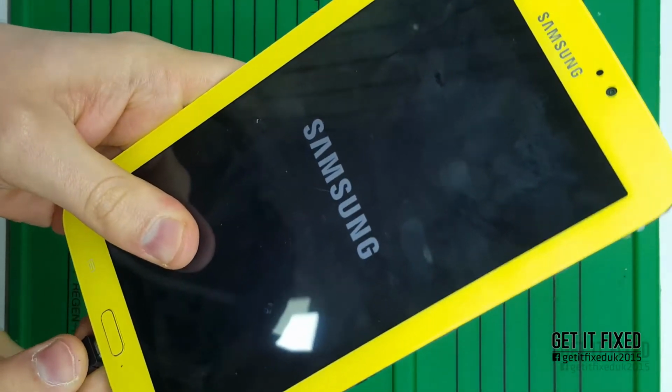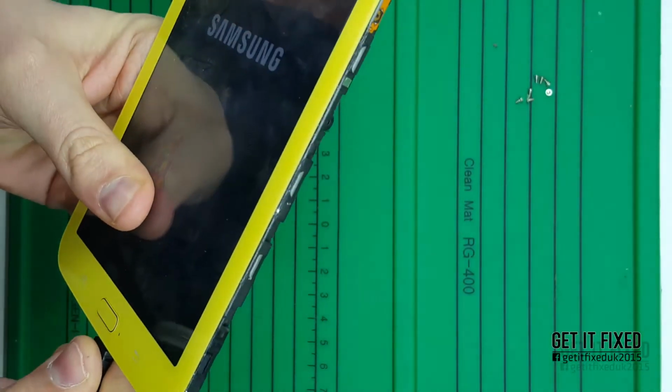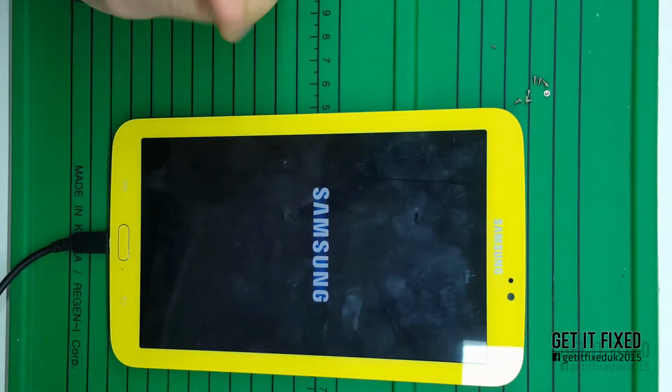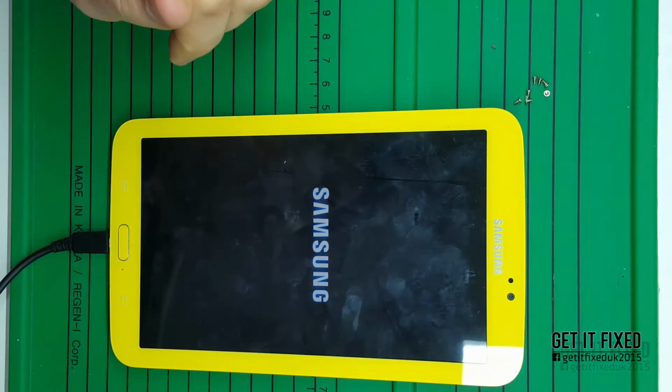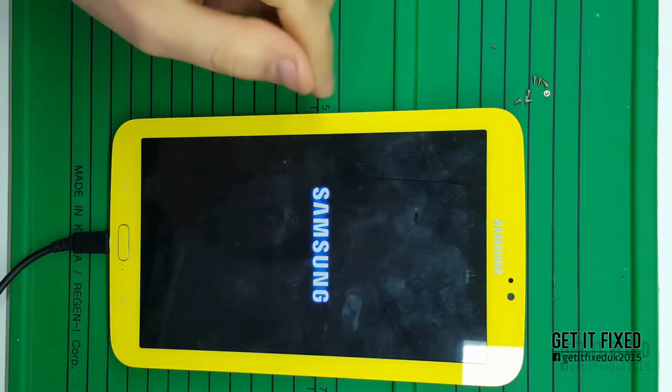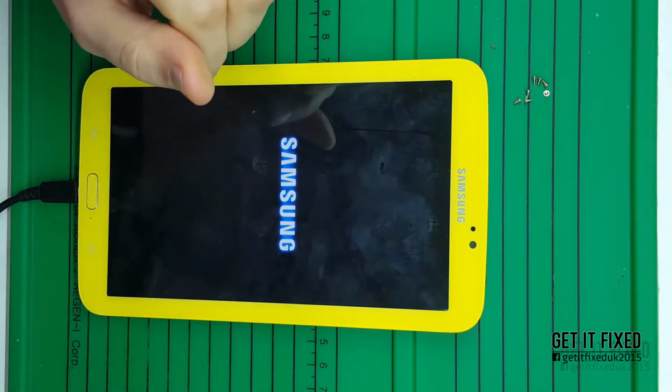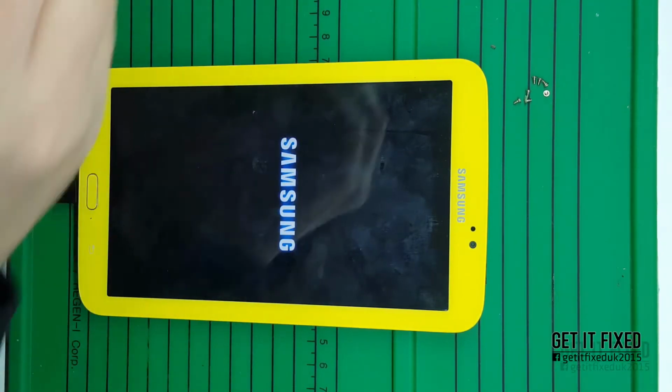Make sure when you reflow the chip, you're not using too much temperature, like 450, and not too high air, because it's going to blow everything. Believe me, it's going to be a huge mess, and you have to realign everything, and it's going to take you a long time.